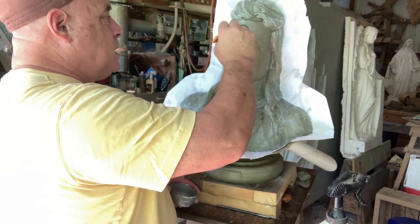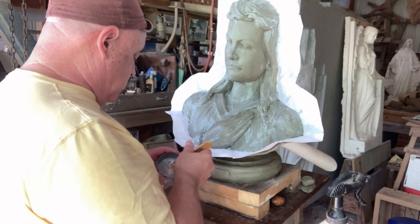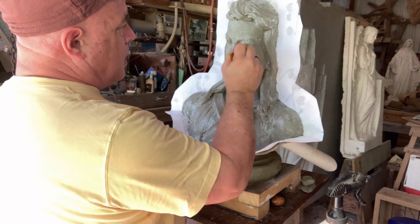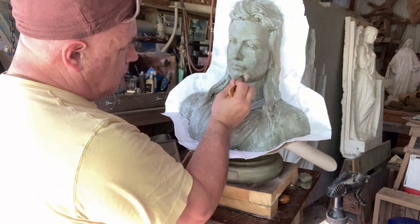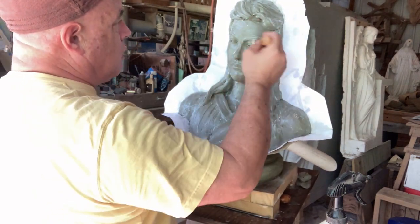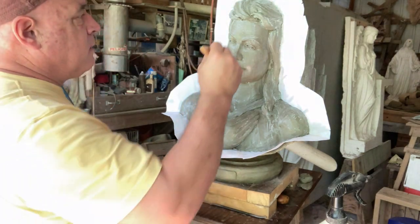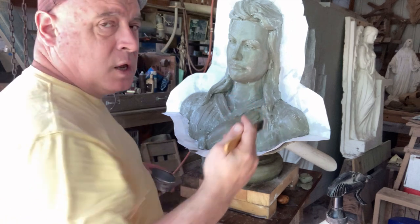And when it's wet, you're going to see every chisel line, almost like you got lines on her now where the brush is. And so it really helps you understand. You can pull your paintbrush for your soap over her contours, and you can see how she looks pretty and how she looks wonky. And so if you plan on having your tool marks, just like for her forehead, if we put lines straight across her forehead, she's going to look old. She's going to look wrinkly. If we've got tool marks that are parallel or phased with her eyebrows, it's going to heighten that awareness.